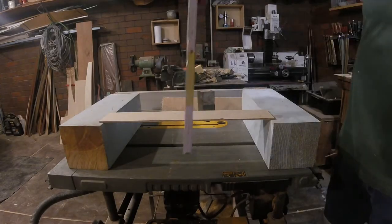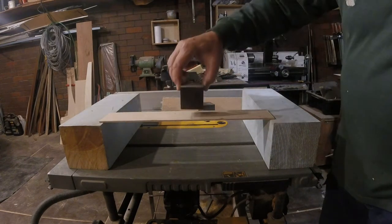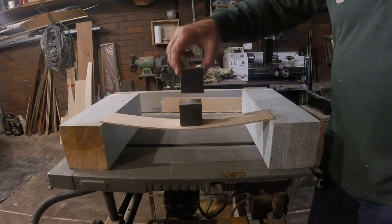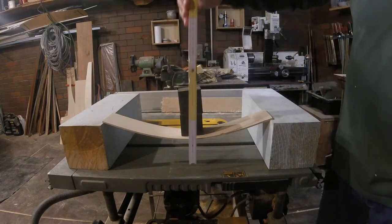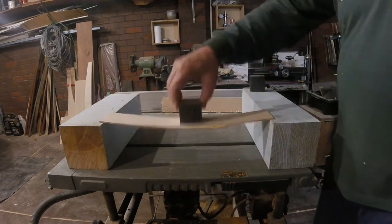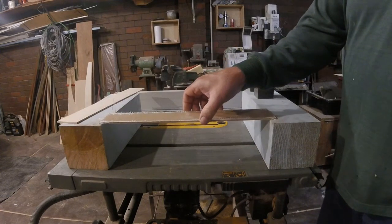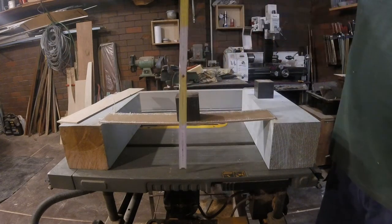Here's how I'm doing the load test — the piece is supported at both ends, measured, and then I put weights on. These are scraps from the workshop, just under a kilo — about 970 grams each — a useful thing to put on the MDF and see how much it deflects. This is sort of like a simply supported beam test, although strictly speaking one end should be fixed and the other on a bearing so it can move as the beam stretches.